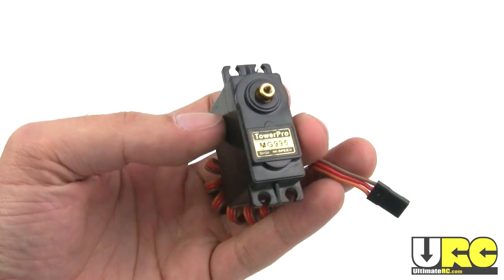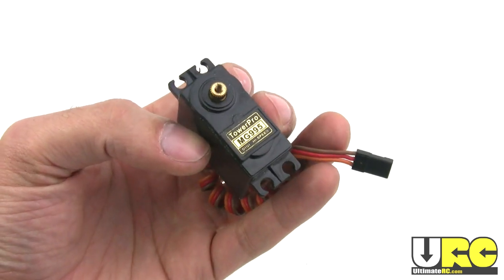Most folks buy them for land vehicle use. It's a standard size, no-frills, metal gear, high torque — failure. This is quite literally the worst servo ever made. Once upon a time there was a Tower Pro MG995 that was a pretty decent bottom-budget basic servo with metal gears, halfway decent in terms of durability. Then it was cloned. Then the clones were cloned. This is probably a seventh generation clone of a clone. You can't even find the real ones anymore. Legal actions were attempted to stop the cloners but evidently those failed, because you can still get these on eBay and they are horrible.